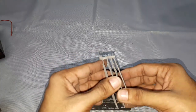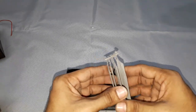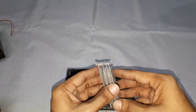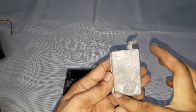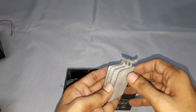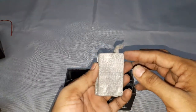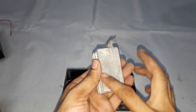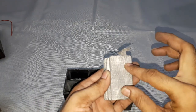You can see these are the negative terminals — that is lead. It is the most important battery component of a lead acid battery. 60 to 70 percent of this battery's weight will come from these lead plates. The grid is made up of lead and antimony — sometimes lead and selenium or other alloys — to make the lead grid strong. Lead paste is then pasted on these grids to form the negative plates, simply as spongy lead fixed on the grids.